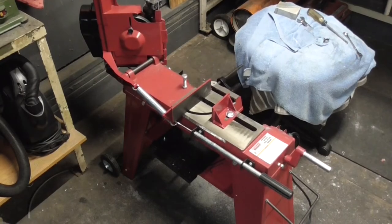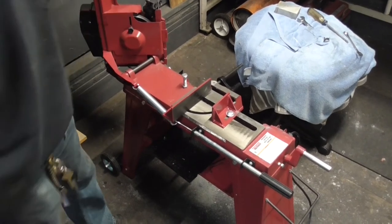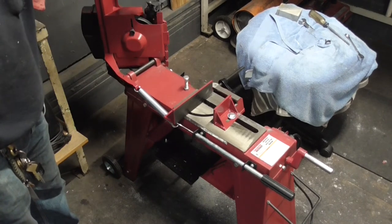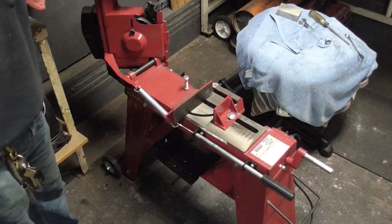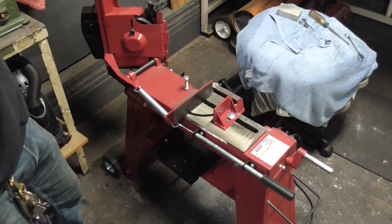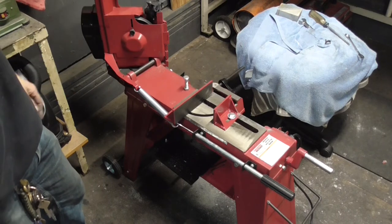All right, so theoretically, that's the only two things that I noticed out of my 10 cuts. But when it went up inside of the bearing right there, it just flattened out the band. And so now it just cuts off crooked. If you've ever tried to cut with a chainsaw that isn't sharpened straight, it does the very same thing. It doesn't lead straight down through there.